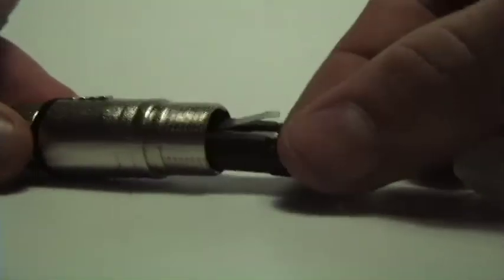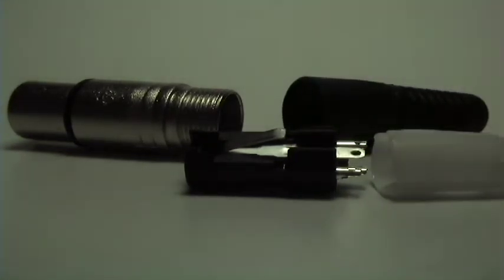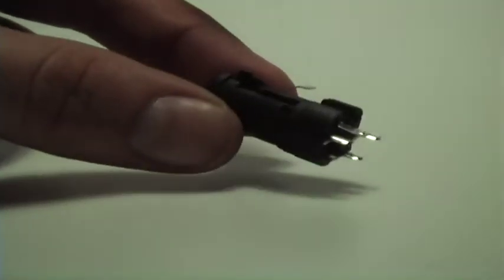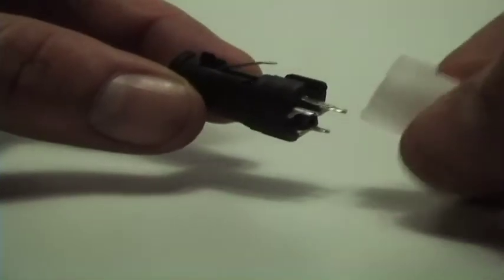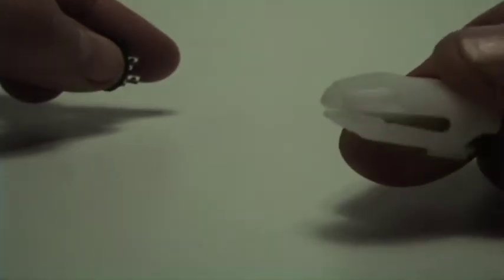Now our higher quality connector actually has a couple different ones. It actually has this rubber boot that we're going to unscrew — the stress relief and the inner piece. This one actually has four separate pieces. I'm going to take a closer look here at the terminals themselves. This is an XLR female connector, and here we have our first stress relief. Now this stress relief actually has three prongs that clamp down as you screw on the rubber boot, which is the second form of the stress relief. Now we're going to take our strippers and we're going to score the end of the cable to get us started.